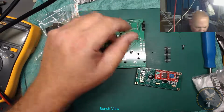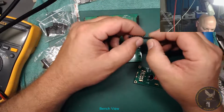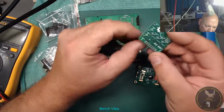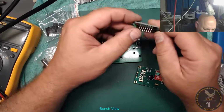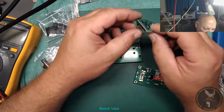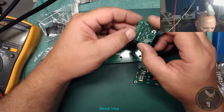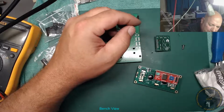Let's solder this on. Turn the soldering iron back on. So 2, 4, 6, 7. So we've got 7 there. Let's solder this on. TAC module. Should I solder that on now, or do I solder the surface mount stuff first? That's quite a tight fit, that. I must have made those holes smaller. TAC module holes are smaller than the other holes, but it does hold the header pin solid. Look at that. See that? Well, I might have to make my header pins. Mind you, that'll make it a bugger to get out again. It's such a tight fit, it'll be almost impossible to get out if you ever want to take the solder off.